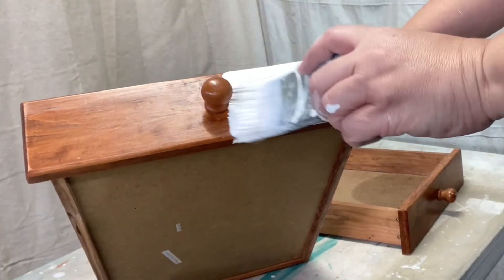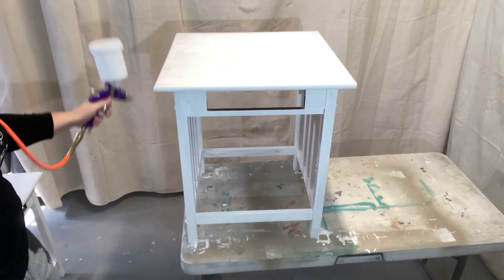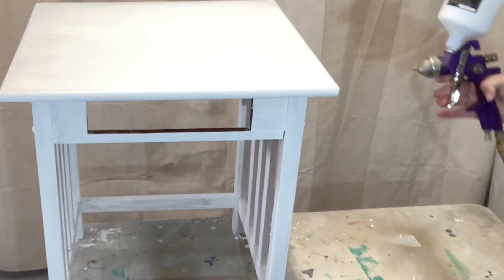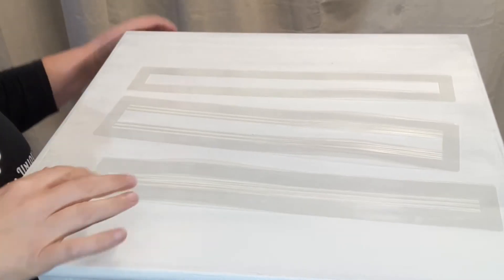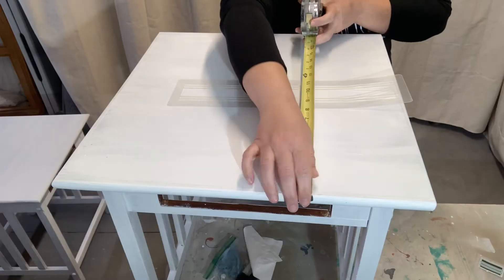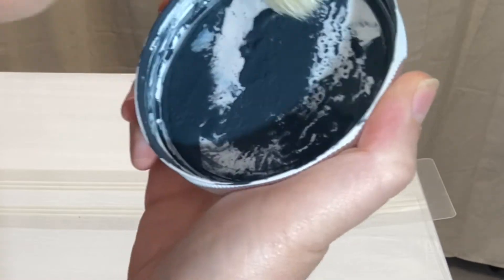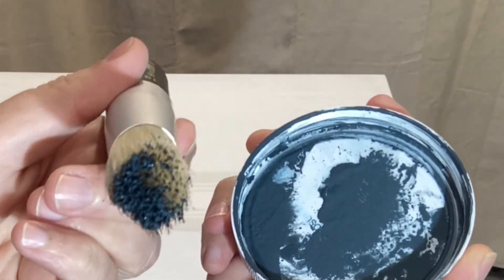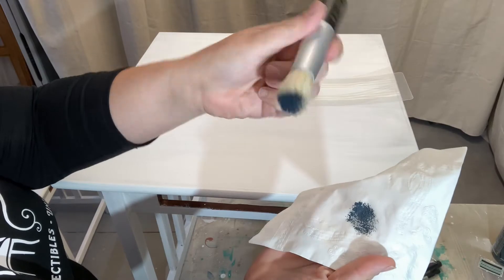I'm giving the drawers a nice fresh coat of paint to match the nightstands. Now that that's all done I'm spraying the nightstands with some clear coat before I start to stencil. The grain sack stencils from Jamie Rae Vintage come with three options, so I'm choosing the one I want and measuring the table to get it exactly in the middle. I'm using a stenciling brush with just a little bit of Denali blue, offloading it and wiping it on a paper towel before I start to stencil.